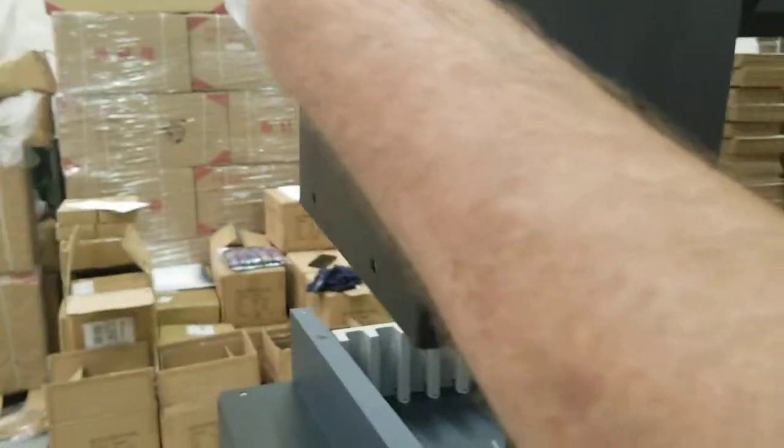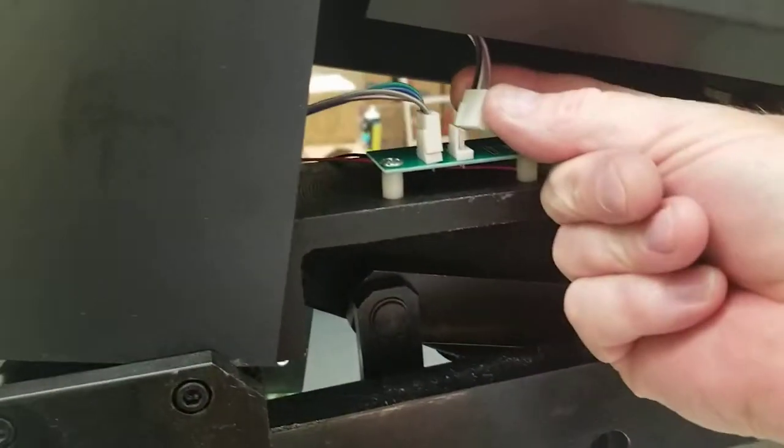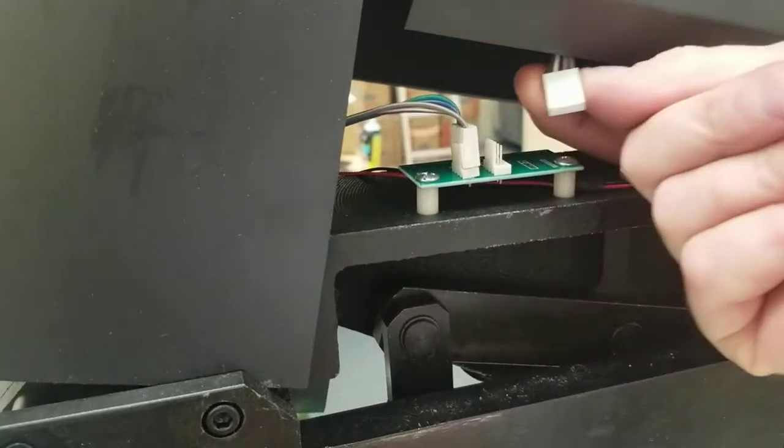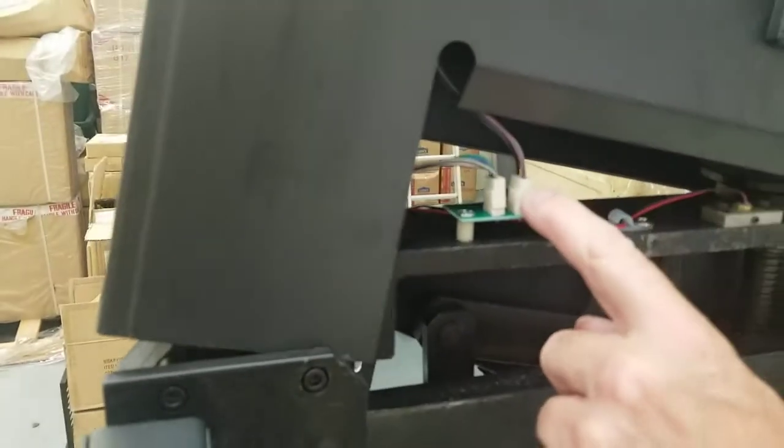Again, if you have someone here, they can plug it in for you, that cable hanging there. But if you're by yourself, you can just latch it behind this plate here and free up your hands and then plug it. Just don't miss any prongs. There's four prongs on that, so you get all four prongs in there nicely. Make sure they're perfectly in there, because if this screen doesn't come back on when you turn it on, you didn't plug that in correctly.